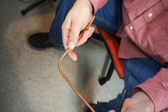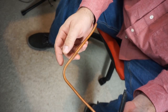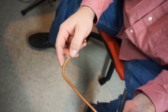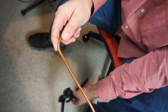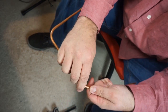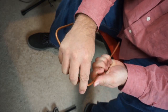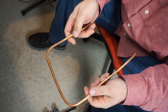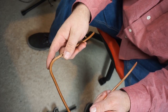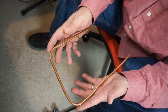That's a beautiful bend. The reason why this is important is because guys and girls, they judge us on what our work looks like, not just how it performs. On the other end, we could bend it by hand — take your time, try to make a nice hand bend — and as you can see it doesn't look bad, but it's just a shade below how the tool bend looks, just a little bit less professional. And it gets harder the larger the copper gets.